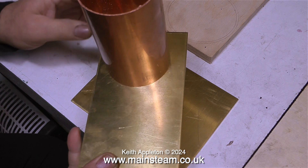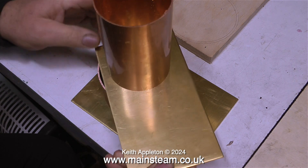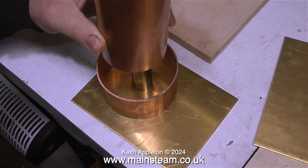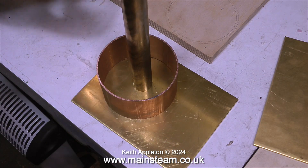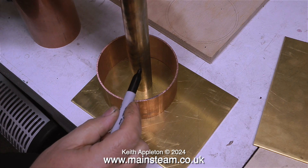So as the injector's working, there will not be water all over the bench. Both the base and this second piece of brass sheet are 3mm thick, and this brass sheet is going to be cut to make the lid and the base of the tank itself. The tank needs to be elevated so there's always water above the injector.